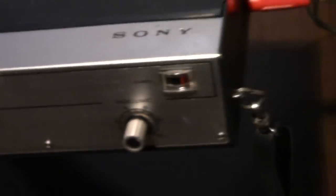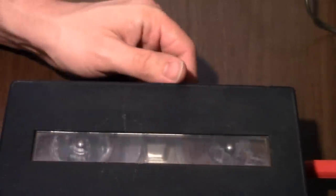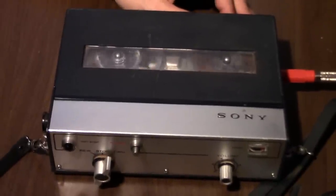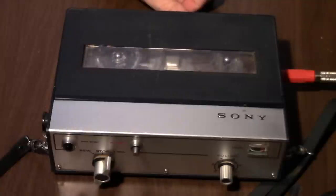this recorder would not power up at all. I opened the unit up and tested for voltage across the main filter capacitor whenever I had the unit with batteries in and in the play position. I had jack squat. Then I decided to take my power supply, set it to 6 volts, and put it across the filter capacitor, and then applied power. And guess what? The motor started spinning to life.